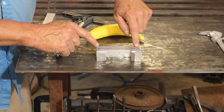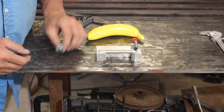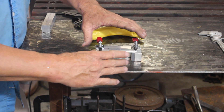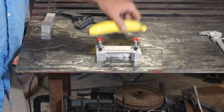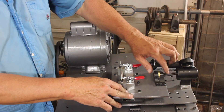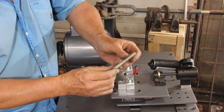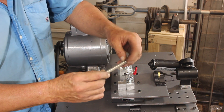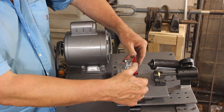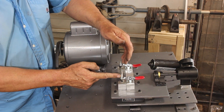I drilled partway into a couple of pieces of aluminum and then cut them in half to make a saddle arrangement. Then I'll come in with a couple of toggle clamps to hold it in place, and we'll mount all of this onto the y-axis, which will move it into the milling cutter and cut the slot down the length of it. The banana is for scale. This is the y-axis — the screw on the drive was way too long so I cut off everything I didn't need. The stock is meant to have a 3/32 inch roll pin in the end, so I put that roll pin in to locate the stock into the fixture every time. Then we throw down the toggle clamps and guide the stock into the cutter blade.